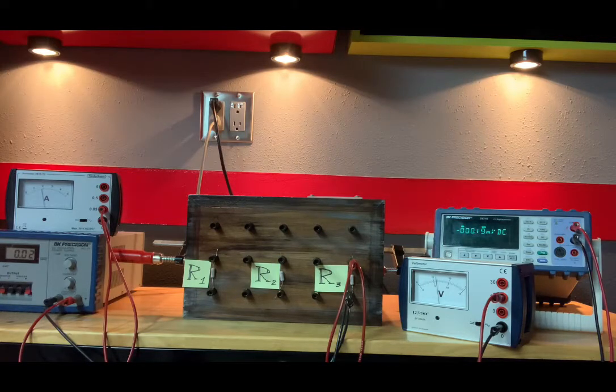The error associated with that scale is, as we did before, 0.0005. Now, from that, you could determine the fractional error. And again, that is nothing more than taking the ratio between 0.0005 and our measured value, which is 0.0181. And I'm getting 0.0276.